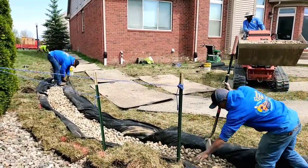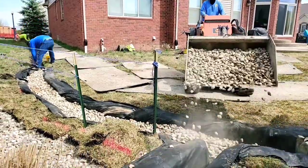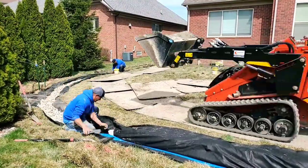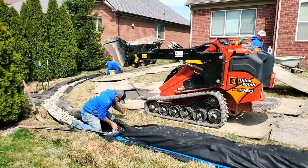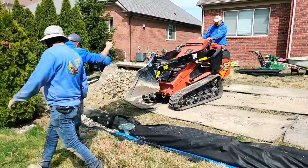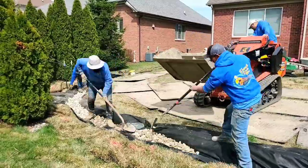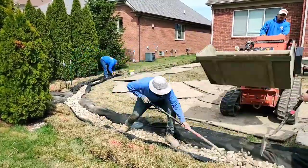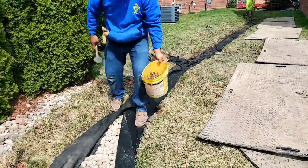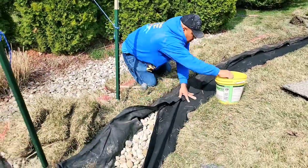Homeowners, keep in mind that your landscape is also causing part of your drainage problem. There was a privacy hedge built up with decorative stone and shrubbery, so none of the bulk water during a really hard downpour could flow into that storm drain catch basin — because the water actually has to flow on the surface to make it into the top of that catch basin. A lot of times our landscapes are not helping us out when it comes to drainage; they actually impede drainage.